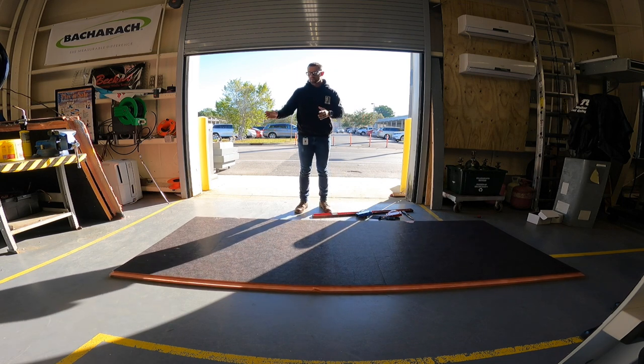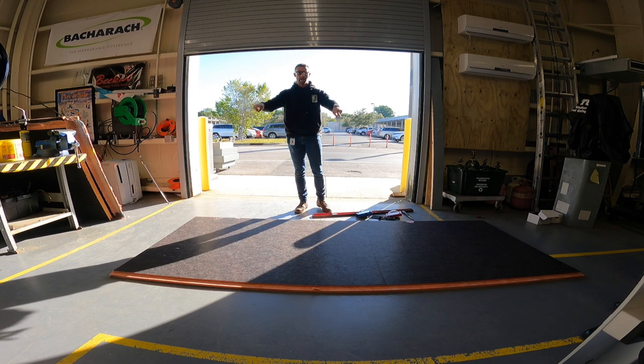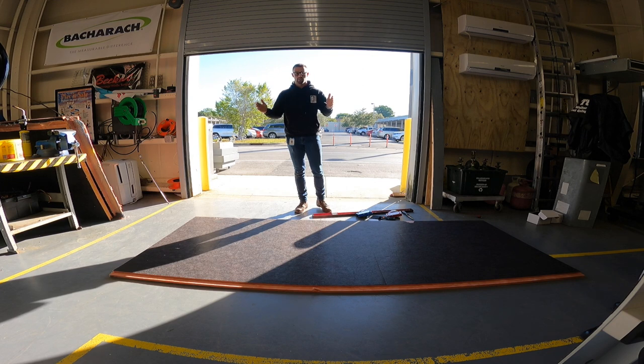I want an 18-inch diameter out there — an 18 by 18 square on the outside edge of my ductwork. So the inner diameter is going to be about 15 inches. We've got to take into consideration the thickness of the ductwork itself.